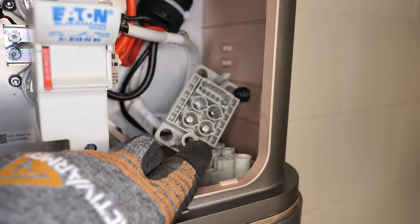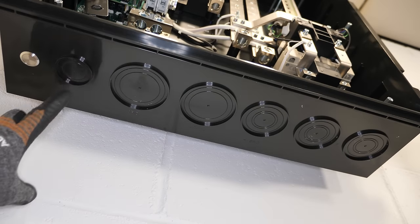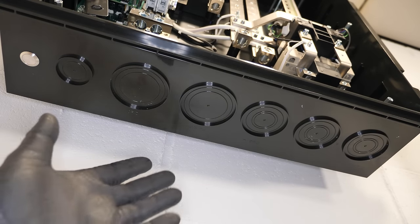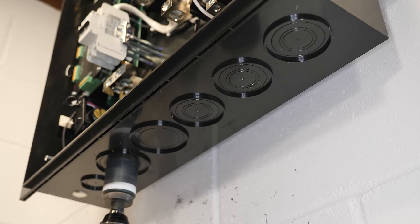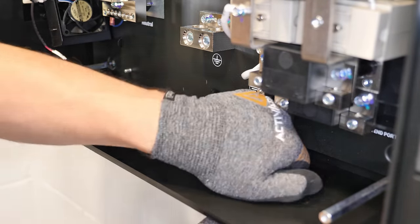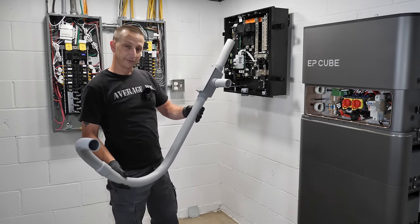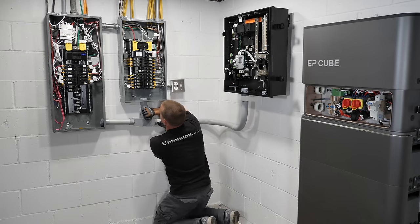In the right-hand corner is the battery connection from the batteries below to the inverter. The bottom of the smart gateway has multiple knockout options — I'm cutting a one and a half inch hole and a three quarter inch hole for my installation. Next I'm doing the PVC conduit — I already glued all the pieces together and fit-checked everything.